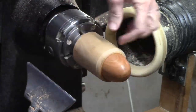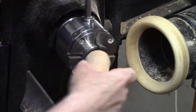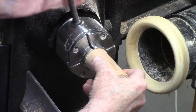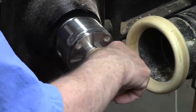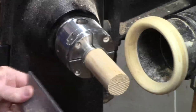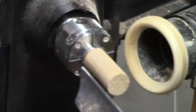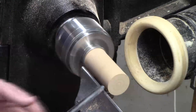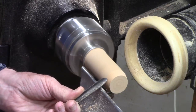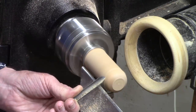For some things, if the wall is thin enough, you can just pop it and that'll vibrate it loose. Now I'm switching to 35-millimeter jaws, but if you don't have 35-millimeter jaws, your other option is to just turn this smaller egg head out of the larger piece and turn it down — just keep it two and an eighth or so you can put it in your normal jaws. This is probably a little bit longer than it needs to be. I'm going to round off the end first using my spindle gouge. Might get a little chatter if I'm not careful — slow the feed rate, anchor the tool, ride the bevel. You've got to keep bringing that curve around and keep riding that bevel all the way around.